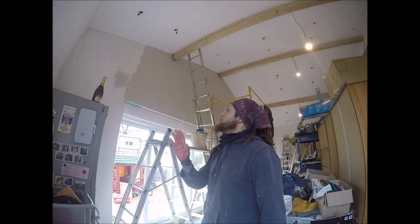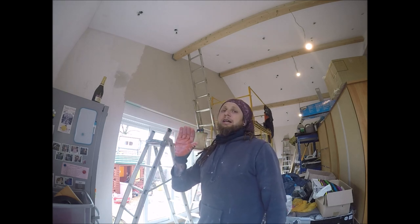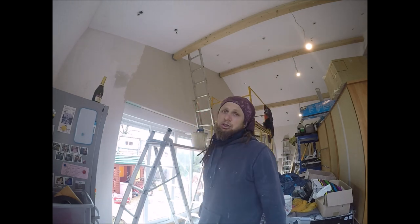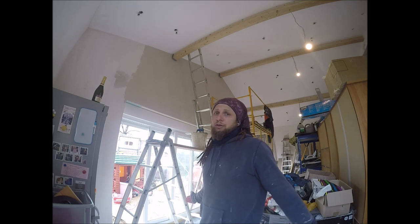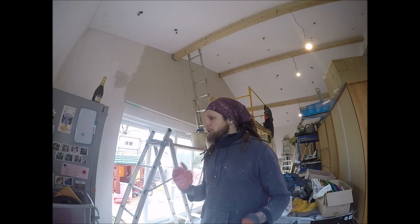And basically what you're going to be doing is just touching the plaster every now and then, keeping an eye on it, and you basically want it touch dry, probably so you're seeing the odd dry patch here and there, and that's when you want to start finishing it off, getting the flat finish to it. We use sponge floats. It's controversial for some people. Some people agree with it, some people don't. Some people use brushes, some people use sprayers. We use all three, depending on the situation.